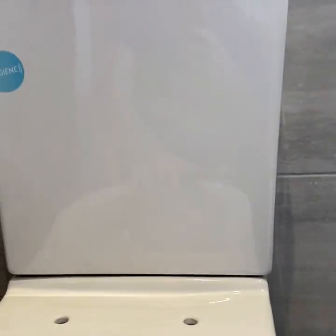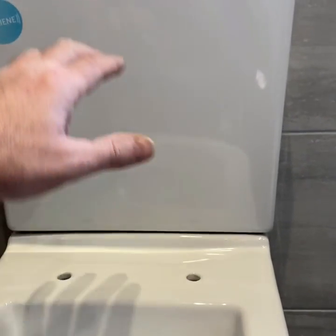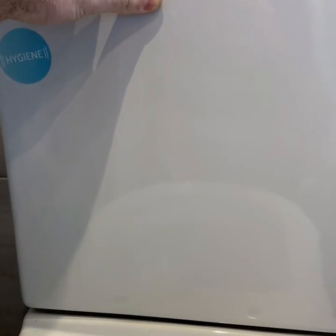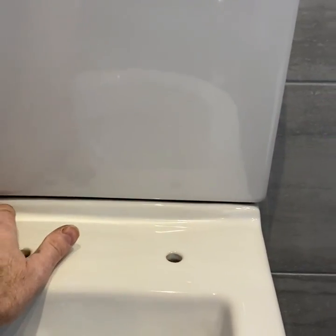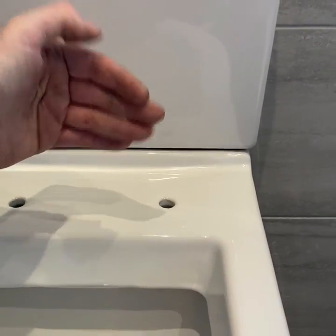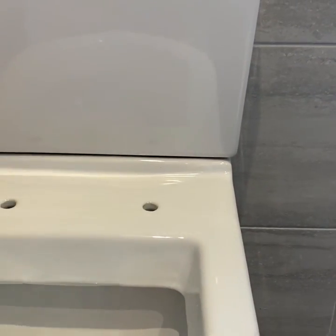And when you're doing these toilets, what you got to think before you screw it back, yeah? What you don't want to do is tighten this too solid. You want a bit of flex in it, because these systems, the pot's never perfect, do you know what I mean? So you need to be able to tweak it back and forth. And see how it's got a bit of a slant on it there, so we'll jack it down a bit more on this side and have the slant perfect. And it don't matter about that, because that blows anyway, do you know what I mean? And you will never see it for the toilet seat. So never tighten it too tight, otherwise you'll be fixed with that bow and you'll never be able to get out of it.